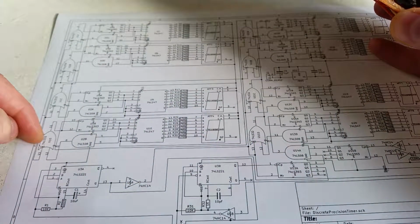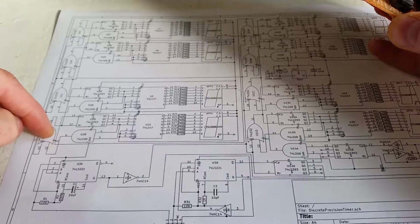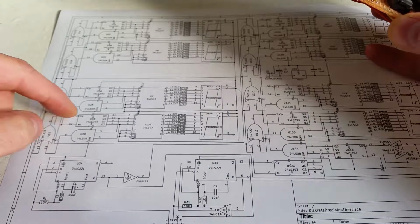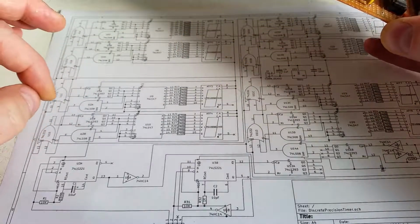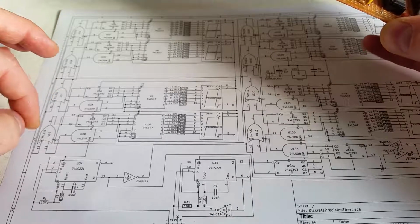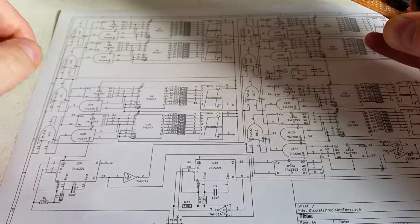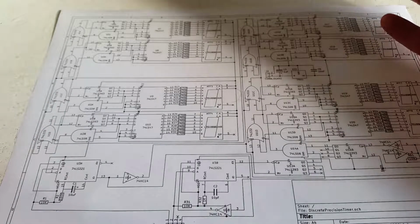And like I say, I'll come back to the other input of the OR gate, which resets the displays, a bit later. But what it literally does is it's part of the reset button. So the reset button gets to it through a different, separate bit of circuit, which I'll cover, and it goes to all of the displays. So the reset button can just reset the count to 0, and it can start the timing again from there.